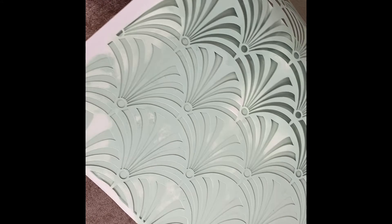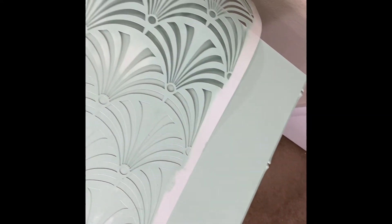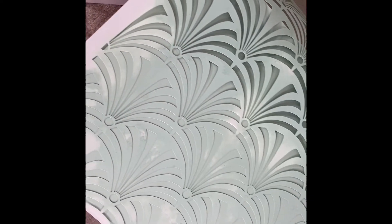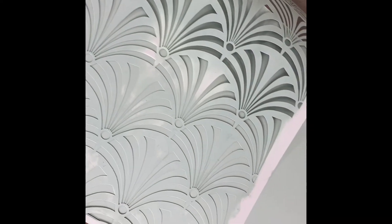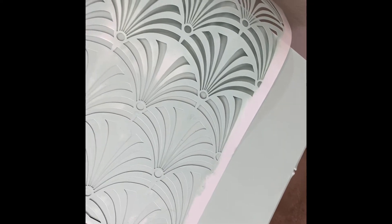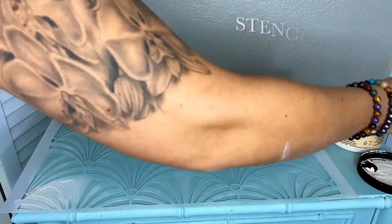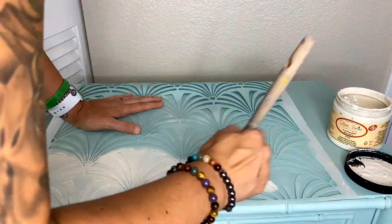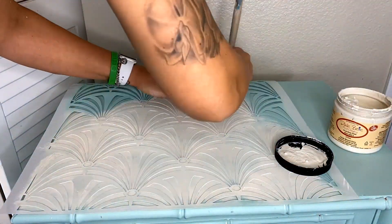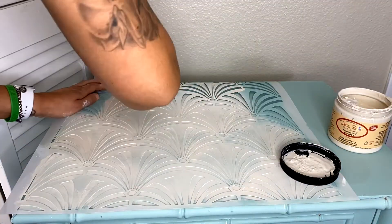Part of the process is that I keep changing my mind on this piece. Now I'm thinking I want to add this art deco arches stencil — which looks very tropical — to the top of this piece before I put the transfer on. So I'm going to grab some white paint and stencil this on. I'm using a slightly off-white for a muted tone, applied with a flat stenciling brush by Paint Pixie. That's exactly the look I'm going for — then I'll take a sanding block and sand it back so it looks a little worn before adding the transfer.